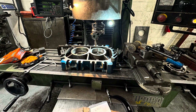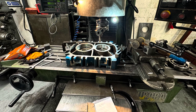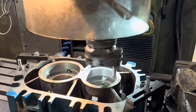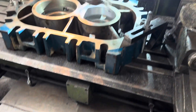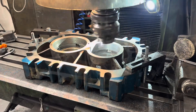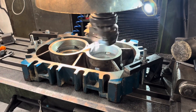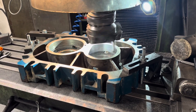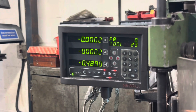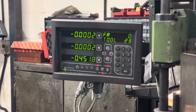After the initial machining on this housing I made sure to leave the job set up in the mill. That way I could be 100% sure that after tapping the sleeve in, everything was in alignment and nothing had moved, so we didn't have to re-clock the bore. We're taking 6 thou depth of cut, so 12 thou off the diameter.